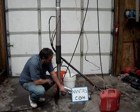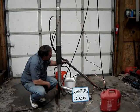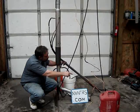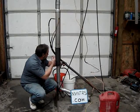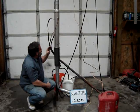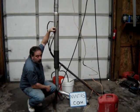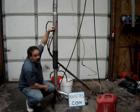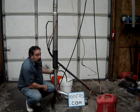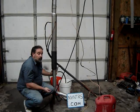This valve is where the water comes off. The spent beer with no alcohol comes out and goes up into this heat exchanger. The hot water goes in the top of the heat exchanger; the pre-warmed beer comes in the bottom — they exchange heat. The beer goes in at the correct temperature designed to get back into the whole system. It's basically free heat to warm the beer up. That's why I can run it so hard and so fast with a limited amount of horsepower and BTUs, because I'm using heat exchangers.